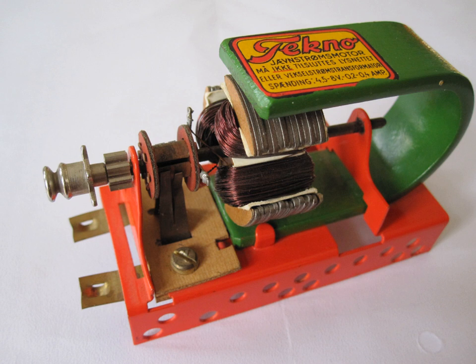The two coils were now separated and placed at the sides of the motor, with their iron core as a sideways figure-8 circuit and the armature in a central pole gap. Flux from both coils passed through this gap, giving a magnetic circuit that was shorter overall and thus had fewer magnetic losses. The more compact coil windings were made possible by the use of shellac for impregnating the windings and improving the reliability of their insulation.